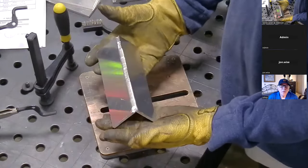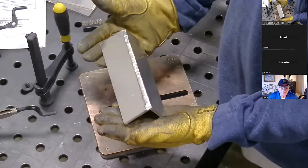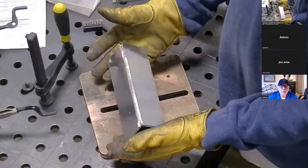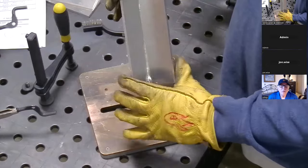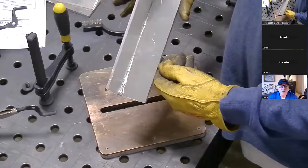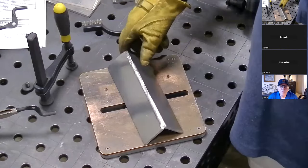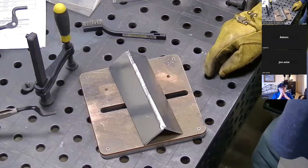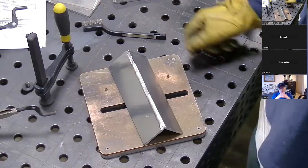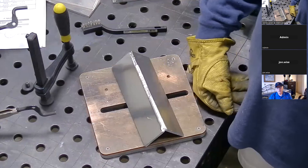That's a single pass — maybe too slow; I got excessive penetration there, but you get the idea as you toy with it a little bit. The part's hot, but not smoking my leather gloves. That looks great. The penetration on the last few inches is beyond what I was expecting. Some of it was probably the part getting hot, but slowing down the wire speed did quite a bit as well. The best way to tell would be to do a fresh one.